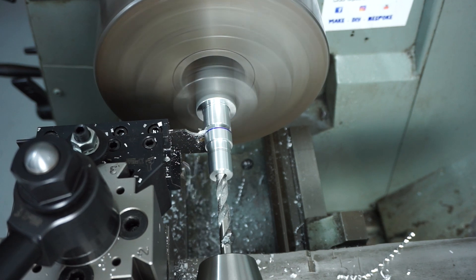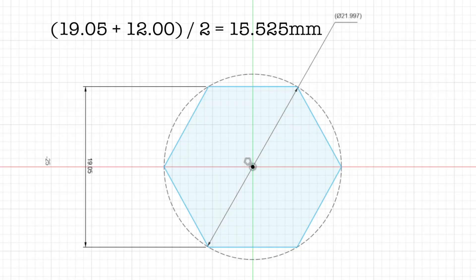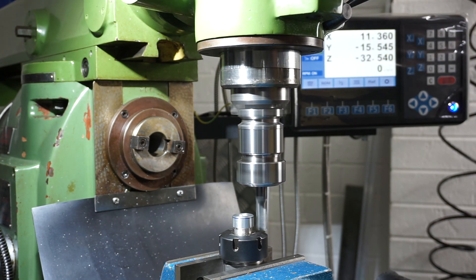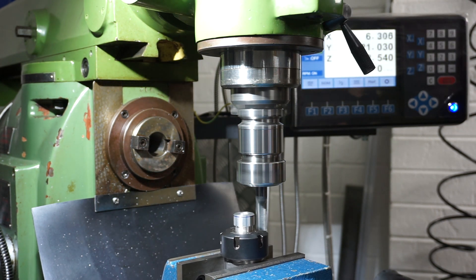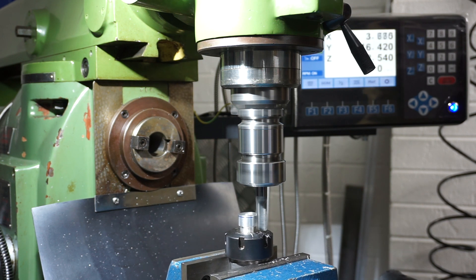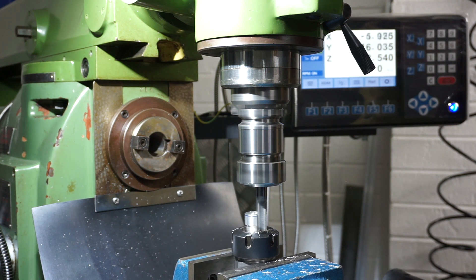To capture the part I'll slide up the tailstock with the drill bit in it and gently insert it to save it falling into the machine. I've used CAD to work out the size I need - my cutting tool is 12mm so I've added it divided by 2, and from the centre offset I need to be at 15.25mm. I've set the DRO on X and Y to the centre of the part as my origin, and I'll concentrate on one side at a time, watching the DRO in Y.